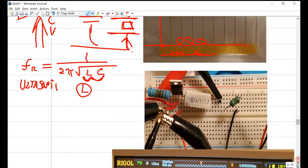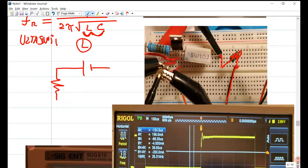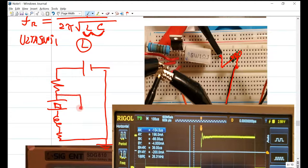Here is the circuit where I added the inductor in — I extended the negative terminal of the piezo through the inductor to ground. In the schematic, we have our crystal, then the inductor, then the 1-ohm resistor to ground, and the MOSFET switch. This creates an LC circuit between the crystal and the inductor, with the 1-ohm resistor for measurement purposes.